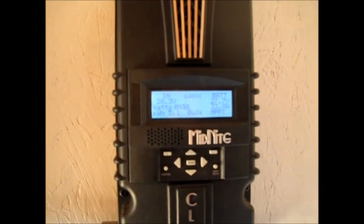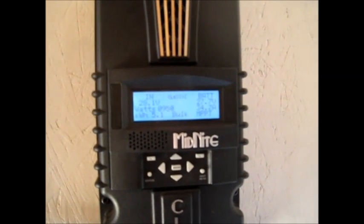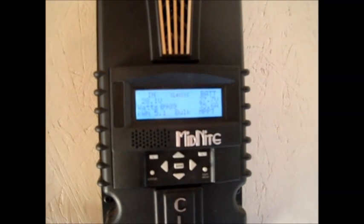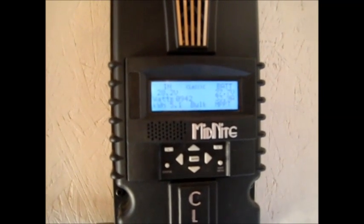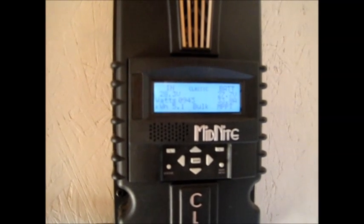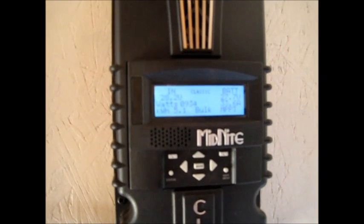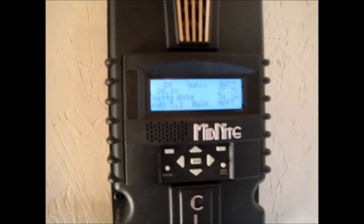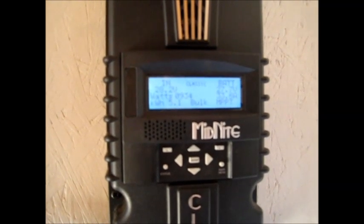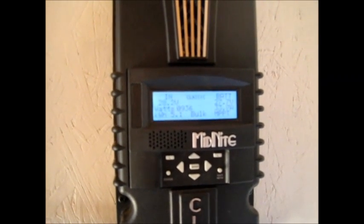Still at about 940 watts coming in. We're at 5.1 kilowatt hours, 28.2 volts coming in, batteries are at 27.7, got 35 amps coming in. Still doing pretty good. Had a little bit of overcast today, but tomorrow is supposed to be clear and sunny for about the next four days. We're at 5.1 kilowatt hours right now — not too bad. That's the second time now we've been over five.